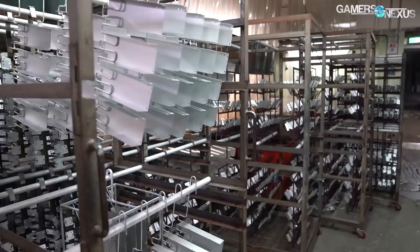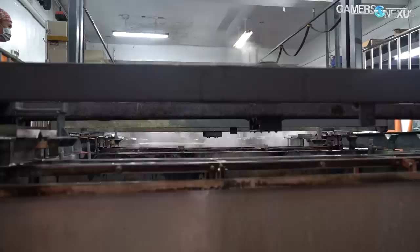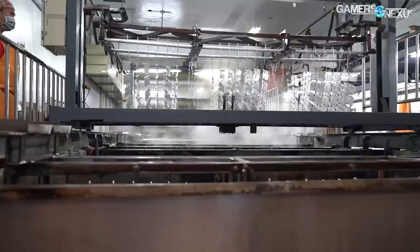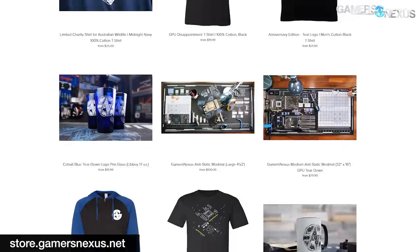The final step is packaging. The factory doesn't sell these parts themselves, so they securely wrap up the parts in bulk and deliver them back to their customers, like Lian Li. Anodization is the preferred process for externally visible aluminum parts, but for a smoother and less expensive finish, manufacturers use electrophoretic coating, or for vibrant and varied colors, they use paint. Each process has its own interesting differences, and we'll have videos on all those factories as well. Check our factory tour playlist in the description for more. Subscribe, or visit store.gamersnexus or patreon.com/gamersnexus for additional information or products.